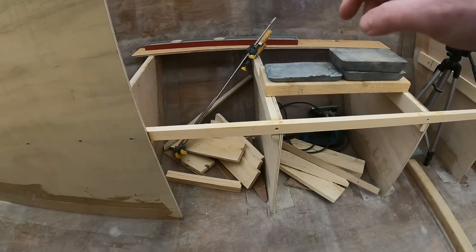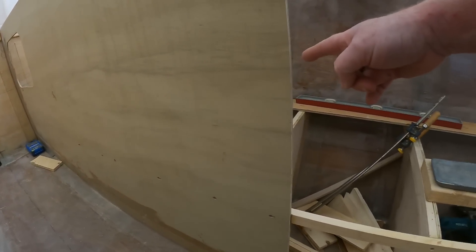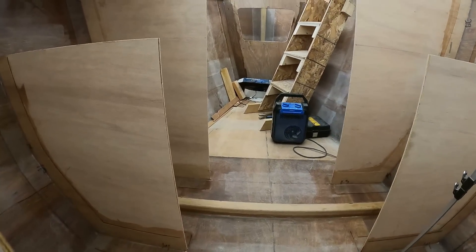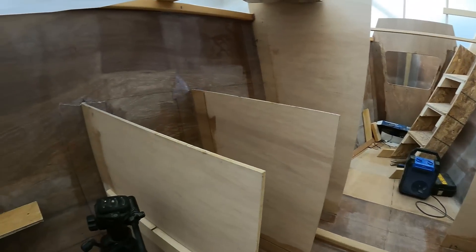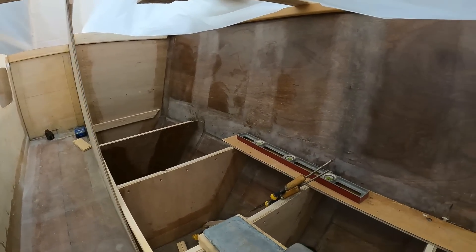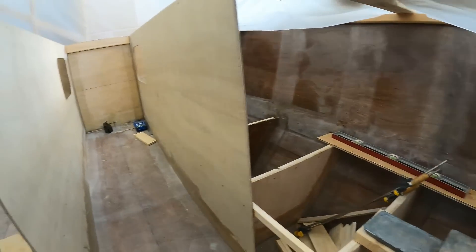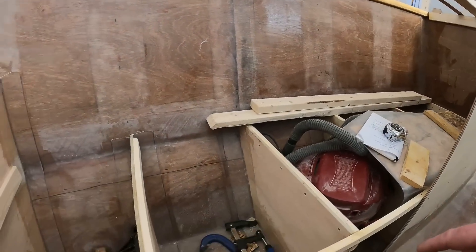The longitudinals will be running right from where this one leaves off, which goes all the way back to the transom — it's eight feet long. Then I'll be picking it up right here at this height and running it all the way to the watertight bulkhead, which is this last big one right here. That's another eight feet. Coincidentally — actually, it's by design — the length of the bunk here is eight feet long. So one sheet of ply will give me enough to do the bunk and one longitudinal. And over on the other side I have the very same thing — one sheet of ply will cover the bunk and the longitudinal.